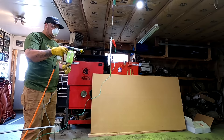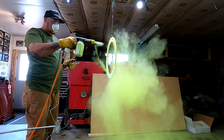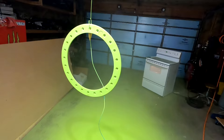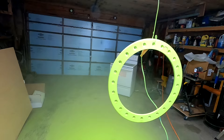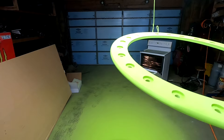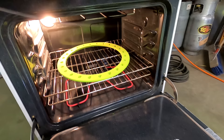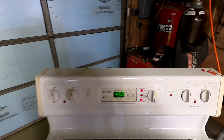I carefully picked up the coated ring without knocking the powder off and put it into the oven. This thing can fit a 17-inch wheel — an actual wheel, not just the beadlock ring. With the oven set at 450, I threw the ring in and after about five to six minutes the powder had already flowed out — it's nice and shiny now, not powdery anymore. I then set the temperature down to 400 degrees and let it run for 20 minutes to fully cure it.